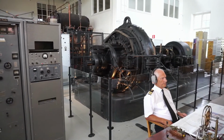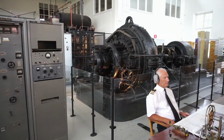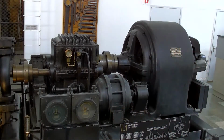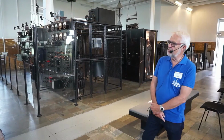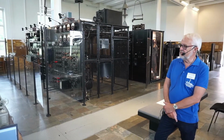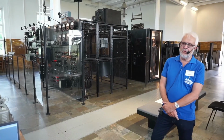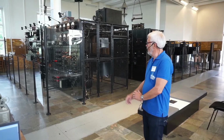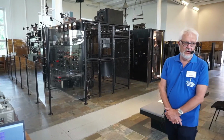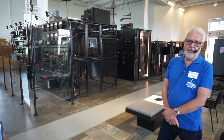And when the main motor reaches its operating speed, 711.3 revolutions per minute, the rotor will rotate with over 2,100 revolutions per minute and give a frequency of 17.2 kilohertz out into the antenna. The motor speed is directly related to the frequency, so mainly all of the equipment you see here is aimed to control the motor speed.